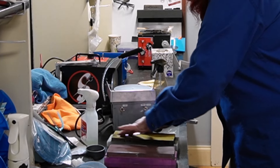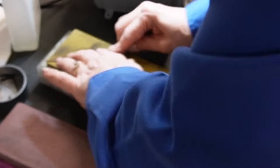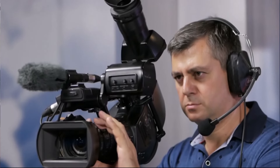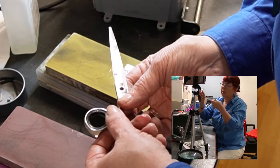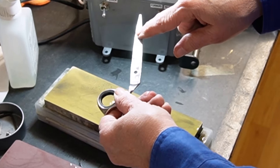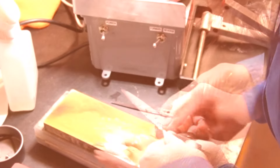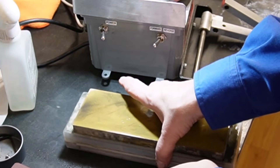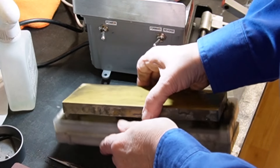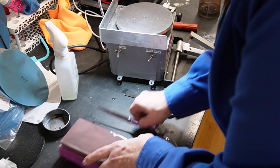Let me bring you in a little closer — the sound will be better too. I'm not a professional videographer; it's just me in the back of my sharpening area. I've got a rod line all the way down — it looks a little subtle right in the middle but it's there. This is the 2000 grit. It looks good. You can see this shear has Teflon in it — that makes them a little quieter and smoother. Now I'm putting my 2000 grit up and moving down to my 6000.